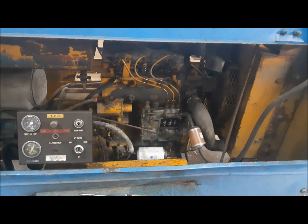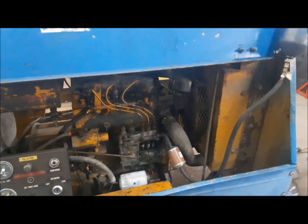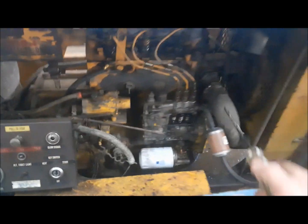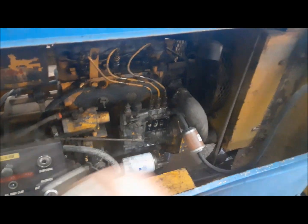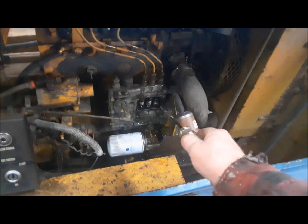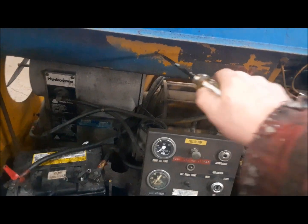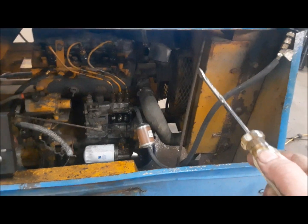So anyway, now that we're convinced that the thing runs and operates, in the next video we're going to go over it and completely service it. Engine oil, compressor oil. This fuel pump, apparently you have to change the oil in it separately. It's got its own sump, so we've got to look into that and figure it out. We're going to get this fuel tank cleaned out and put a fan belt on it.